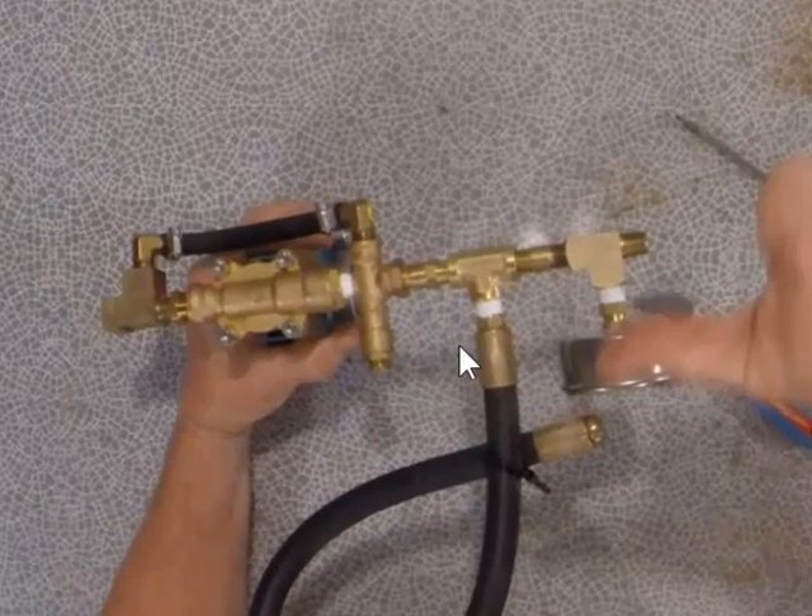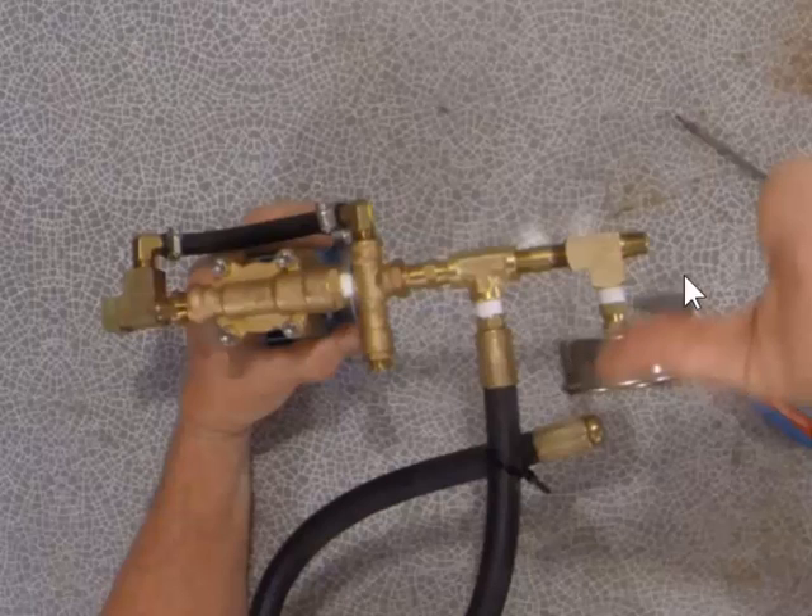This is showing the completed unit, and here are all the components. The pump is right here, the bypass line, bypass regulator which is part of the pump, and then the several fittings that make it up. This is a bare-bones system. Your input water comes in here — input water is low pressure, 0 to 60 PSI depending on what you have. Output water can be regulated from 100 PSI up to 1,000 PSI; it gauges up to 1,000 PSI. You regulate it through this regulator here — there's a little stem and an Allen wrench fitting. It causes the pressure to go up or down. The high-pressure water is delivered out this output to the nozzles or whatever medium you might have.